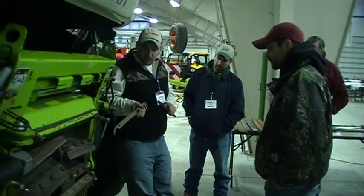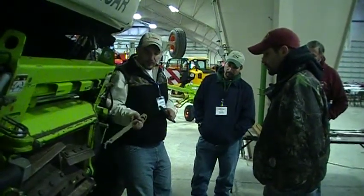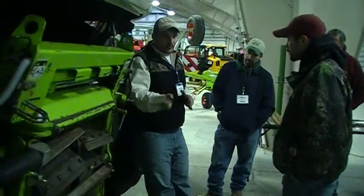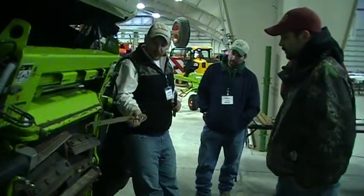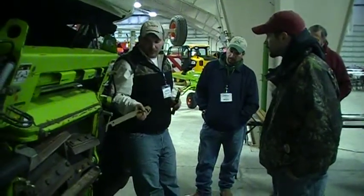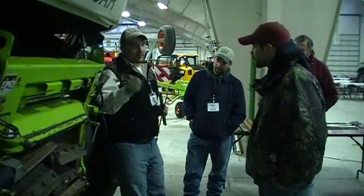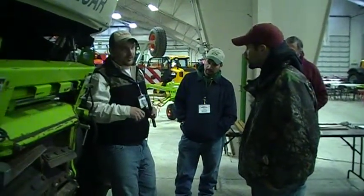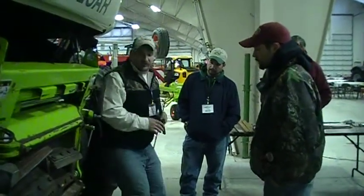I would also recommend, when you go to torque the bolts, this is what I do, is I mark every bolt head with the paint pen as you're going through. On this one, you start on the inside and work your way out, so you go 1, 2, 3, 4, whatever your pattern wants to be. But I just do a daub on every bolt that I torque, just so that there's no question when you come back through, you get all the way back around, you're like, well, did I do it or did I not? It's just quick and easy.